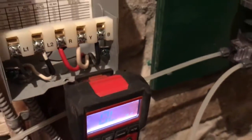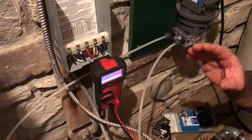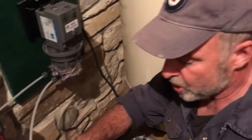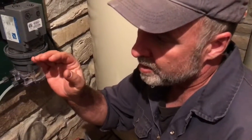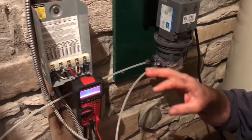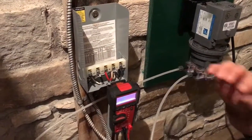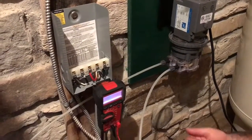My system is working fine, but that's the test procedure you'll go through, and you will find some problem somewhere. Either there's no electricity coming into the system, your pressure switch contacts are faulty or not closing, or you've got something wrong with your pump. Two of those things are easy above-ground fixes. But if your multimeter ohm readings are off, you know you've got to pull that pump from the well and get a new one.